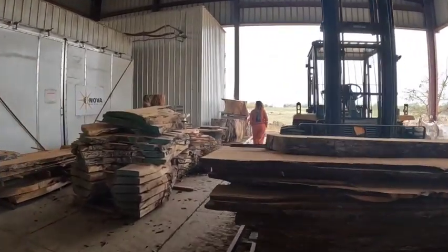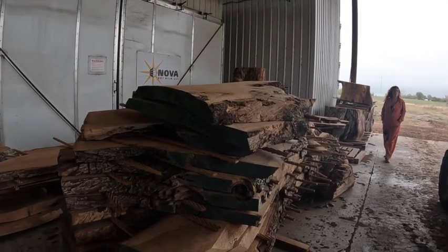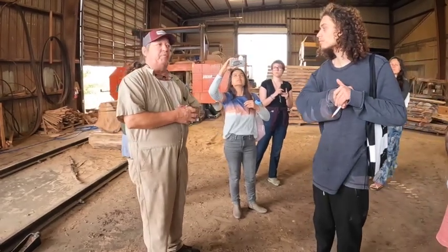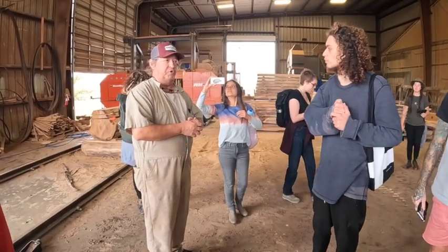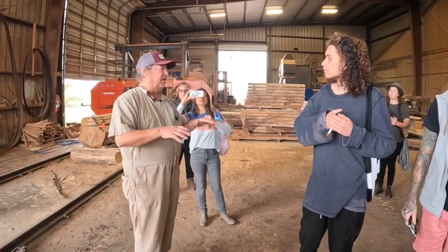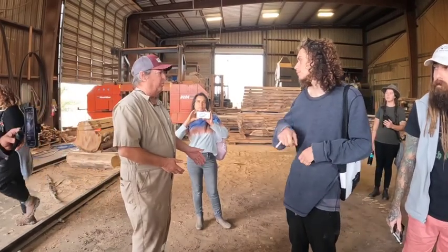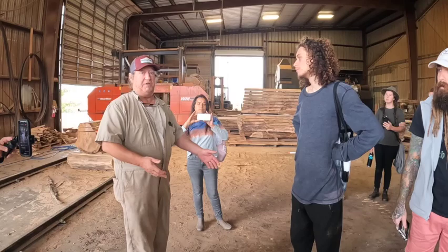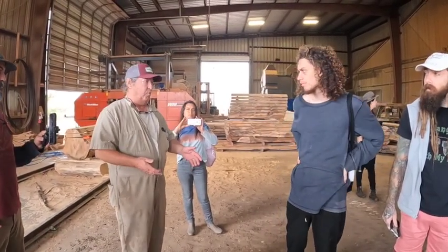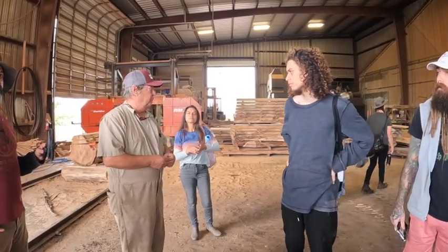It goes into those kilns. The small kiln holds 10,000 board feet, and the big kiln holds 14,000. We end at 145 degrees Fahrenheit 3 months later, and we're trying to get the wood moisture content down below 11%. Wood naturally stabilizes at 11 or 12% in this environment. If you drive down to 6 or 7%, you're wasting energy and time, because it's going to come back to 11% just sitting out. Okay? But you don't want to make wood out of stuff that's 15 or 20 or 30% moisture content. You don't want to do that.